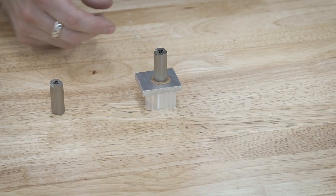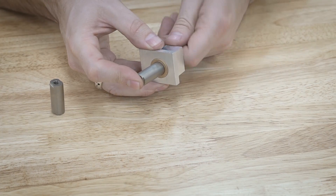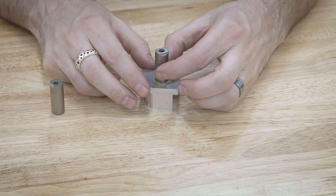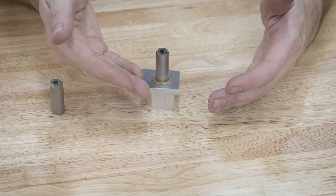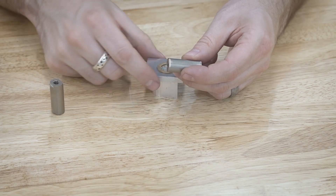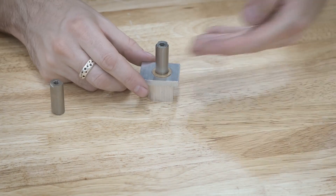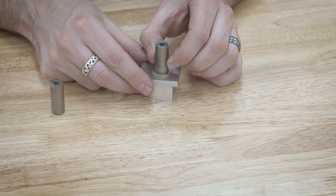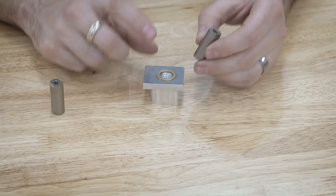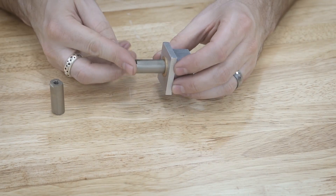The reason I do this has a couple of different reasons. If this key isn't there, when I try and tighten it from the back side it could just end up spinning, which would be kind of annoying. But the other reason is from side hits - I'm not a hundred percent relying on the shear strength of the screw holding it into the frame. I'm actually relying on the strength of the frame as well, so any lateral forces coming in will be pressing against the side of the frame rather than just relying on shear force of the screw. So yeah, let's start talking about how these were made.